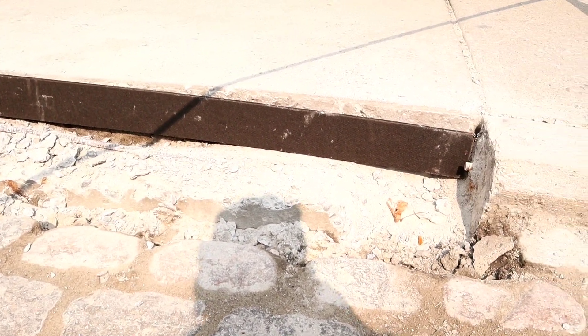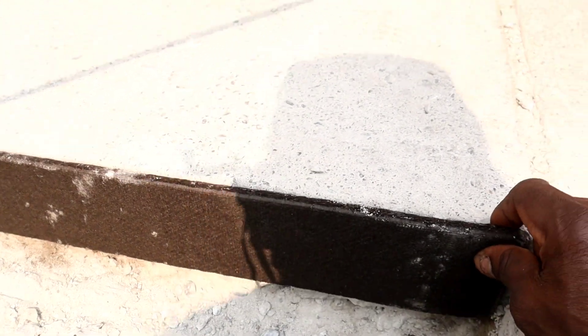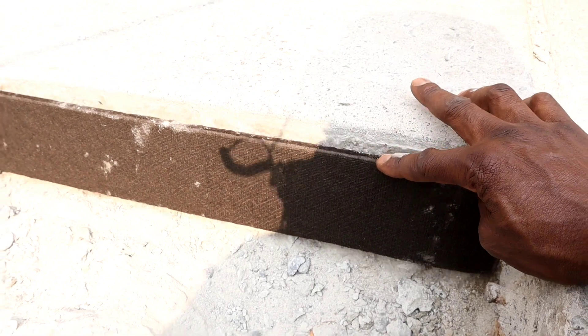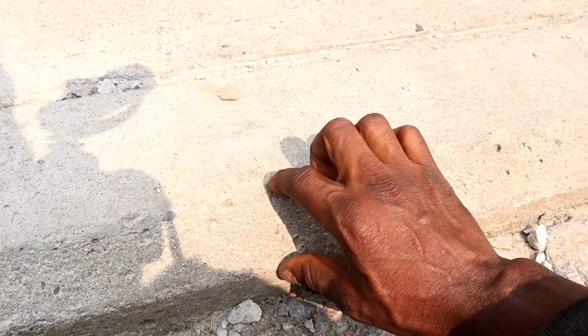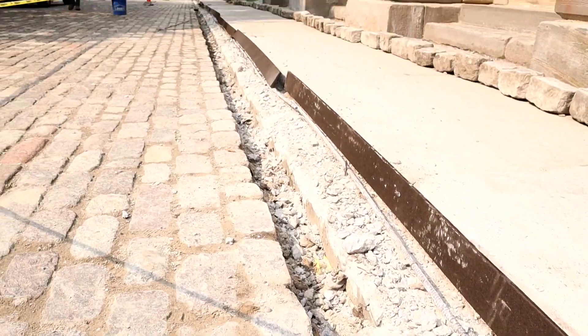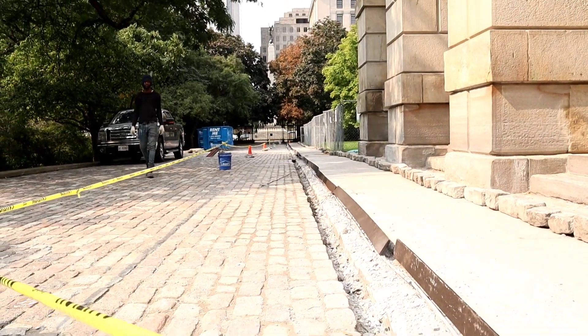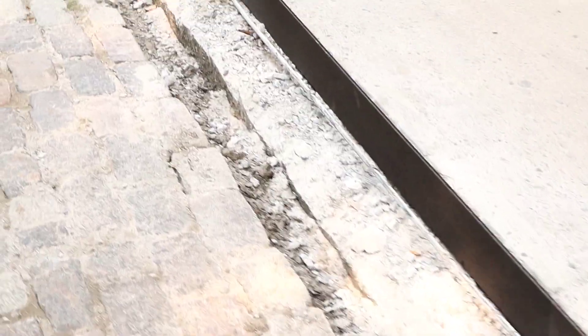As you can see, that's my softboard. We're going to put the softboard right here — it's going to sit flush with the side wall, and then my concrete is going to come right out there. That's where the curb is going to be, just in line. This curb goes all the way down — it's 202 linear feet going all the way down there. We are ready to finish installing our rebar.